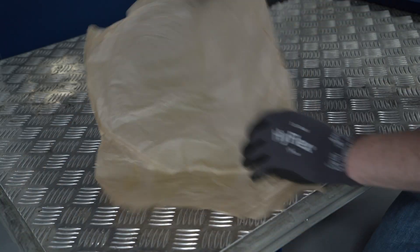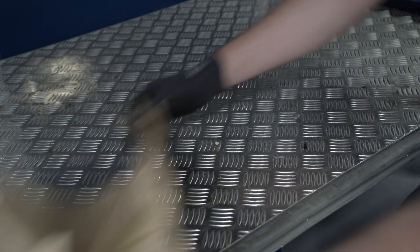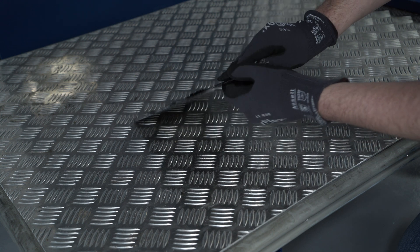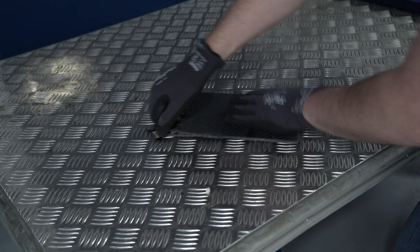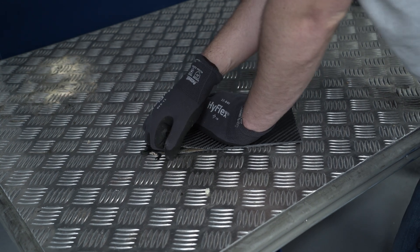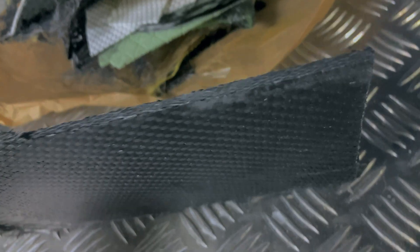I'm now showing you some baking paper. I use it as a cheap release film when making test sheets — it's less wasteful than nylon peel ply and smooths flat without bubbles more easily than plastic release film. I've sandwiched a little of it between the leading edge of all the next test plates, so I can wedge apart the two halves and try a forced delamination. This is a pure carbon sheet, and eventually I got in between the two unbonded ends, but I could not continue the laminar fracture any further — it's bonded too well, almost like a single entity.